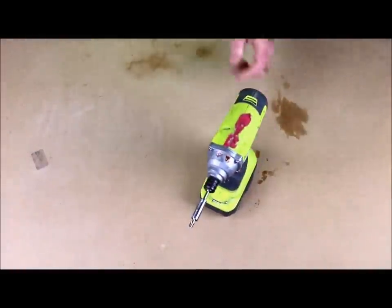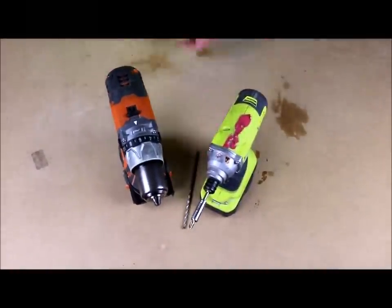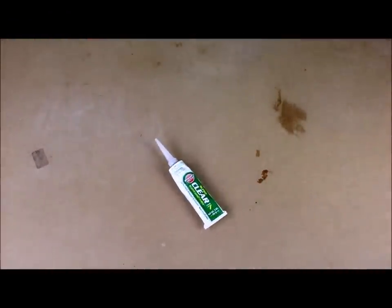For the tools needed for the project today, you're gonna need a pair of safety glasses and gloves, impact drill, and a standard hammer drill with a 3/16 masonry bit, 3/8 diamond tipped glass cutting bit, copper pipe cutter, wire cutters, plumber's putty, about a foot of weed whacker string, and a tube of silicone.